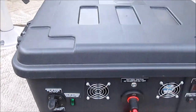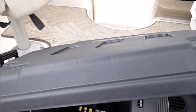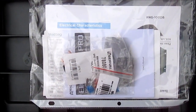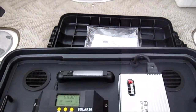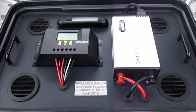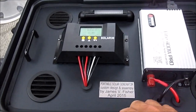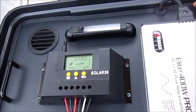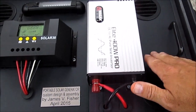I'm going to take you to the inside of the case and point out a couple of different features. One thing you should always remember is to keep all of your documentation and some spare fuses on hand — I keep them in an envelope attached to the underside of the top of the case. I also made an improvement to this top tray: around the edge you'll see some automotive rubber stripping, used as a finishing product to create a nice seal around this deck to separate the battery compartment from the upper tray.